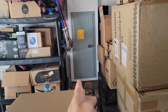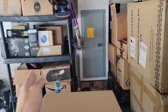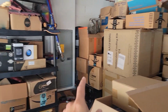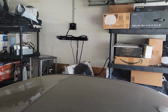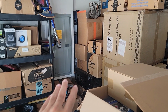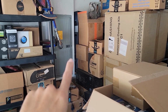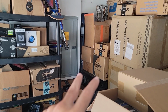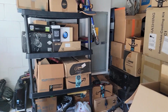So we can't go directly through that wall underneath that power panel because the power might be coming up from the ground. So we need to go either to the left or to the right. And we need to take the 10-2 line that's already over there, and bring it back over here and bring it down the wall to set up 2 PDUs is what I'm suspecting, or maybe 1 giant PDU, because we're going to need 2 30 amp breakers. We already got one that we're going to bring the 10-2 wire back over, but we're going to need another one, and either 2 PDUs or 1 PDU to power 2 ASICs plus the C2.